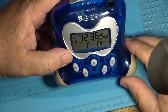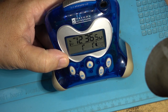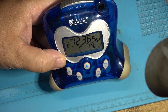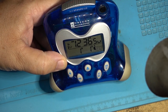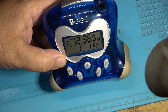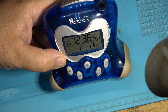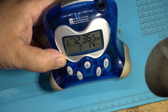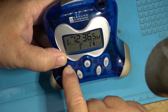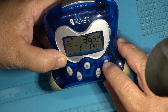How these operate: every — I think four times a day — they try to synchronize, though typically the signal only comes in at night. This is a long wave at 60 kilohertz transmitting frequency, and those signals generally only come in at least where I am when it's dark. Usually it starts at 12 midnight looking for a time signal and tries at 1, 2, 3, 4 o'clock in the morning, or when you force it. You can push and hold one of these buttons — that's for setting the time manually.